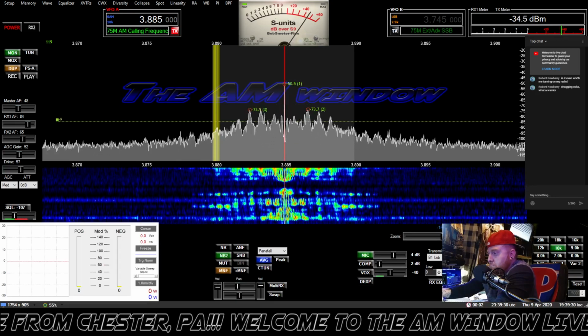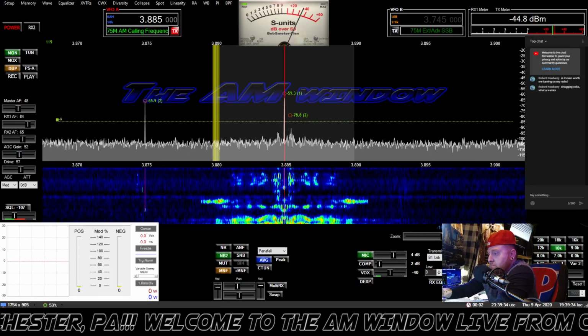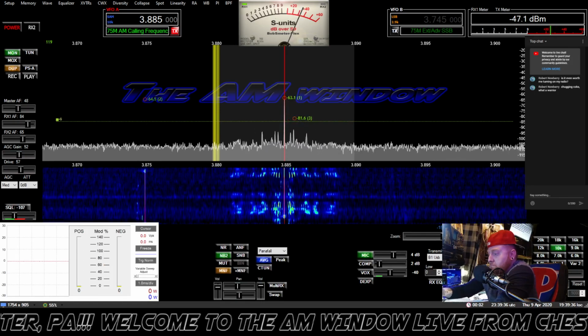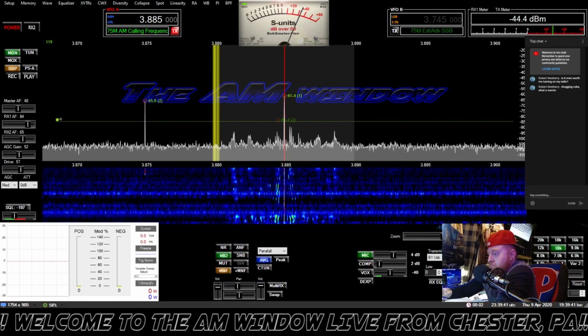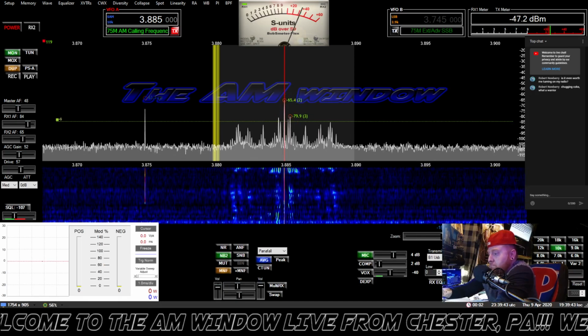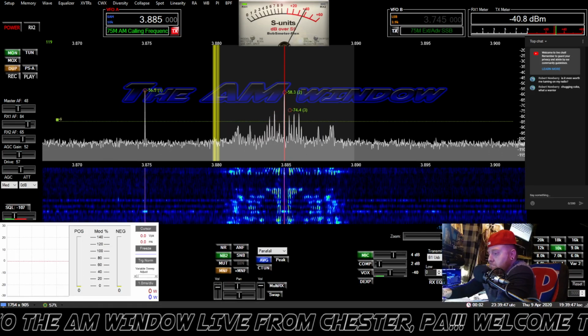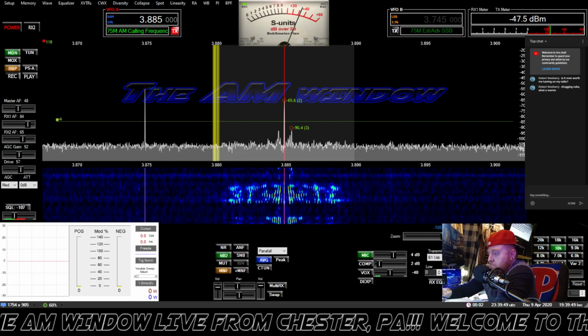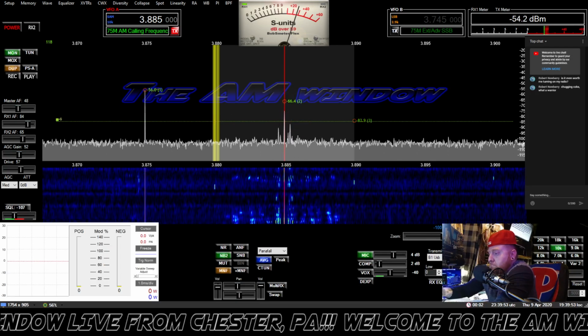You got the hammer down. Nice. Yeah, copy on that. Okay. Yeah, I put a voltage regulator on the screens of the 807s to hold them steady. Changed the interstage transformer. Did some mods on the audio section there for the preamp and the audio amplifier.